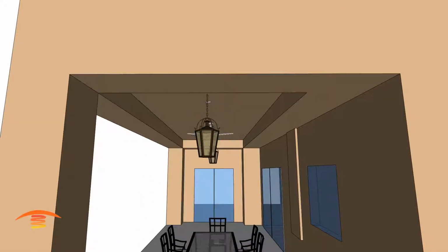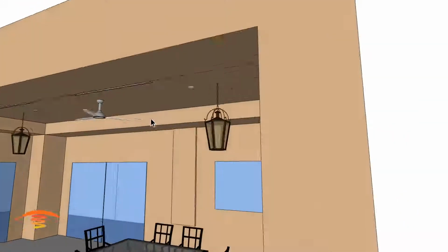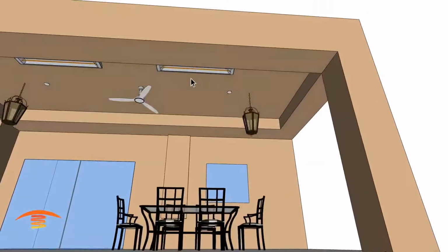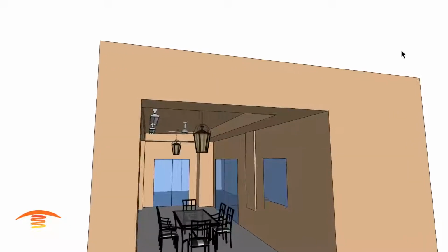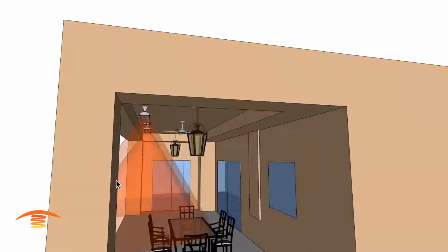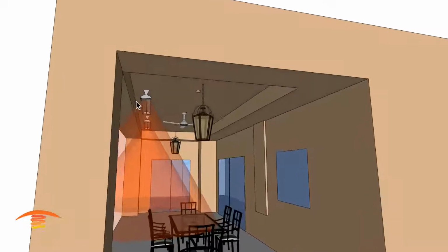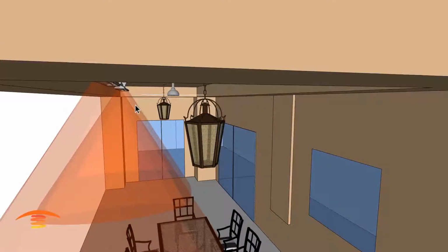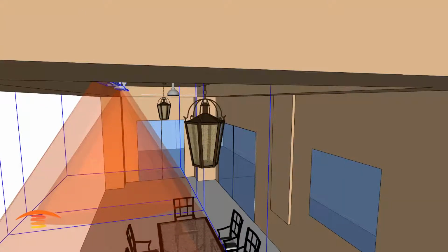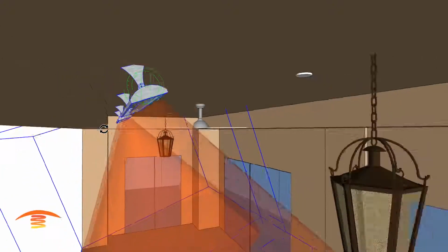With that being said, looking at electric heaters, we can place electric heaters in the same fashion as we did the gas heaters. We'd have to use a shorter unit, I believe, to make it go from here to here, or we could just do what I'm showing here, and that is to have some electric heaters placed on this edge over here. I have 6 inches of clearance above, 6 inches of clearance on the side here, and if I just did an angle on both of these, a general angle, I'm going to go with a 20-degree angle here.